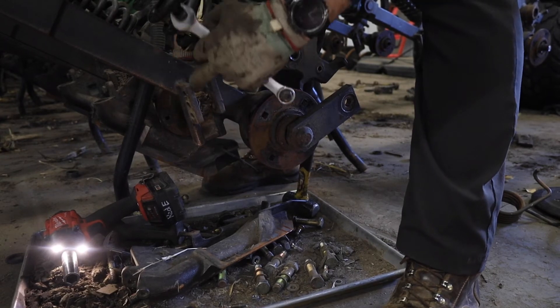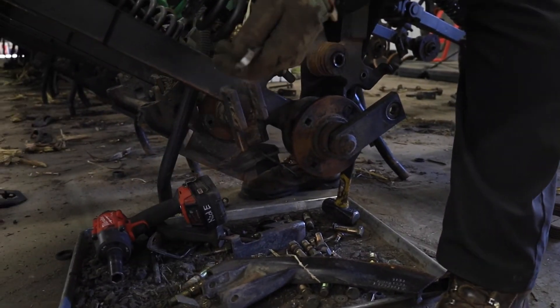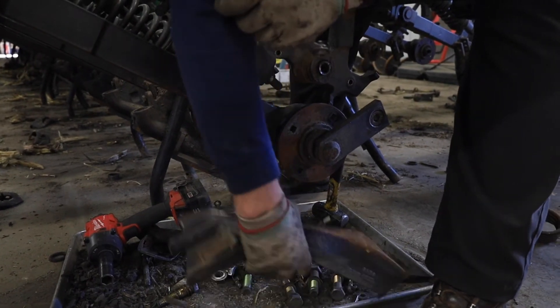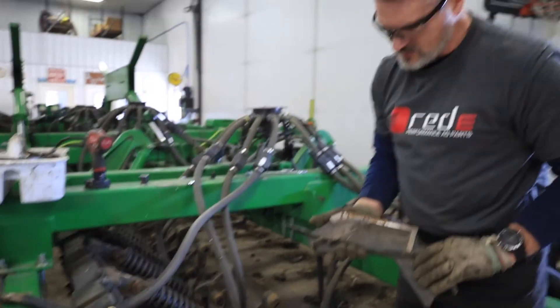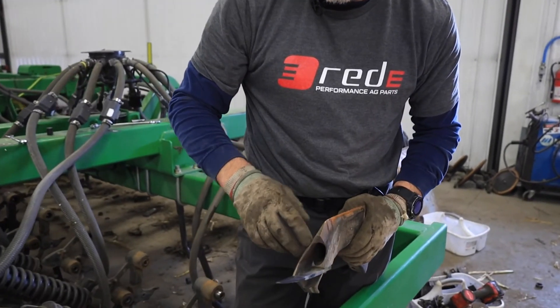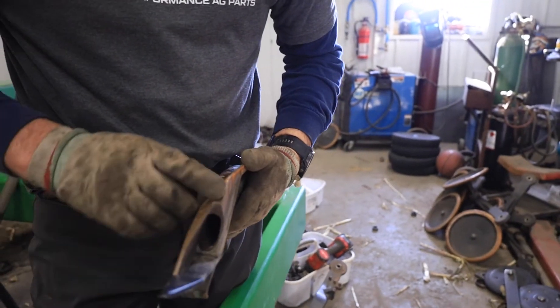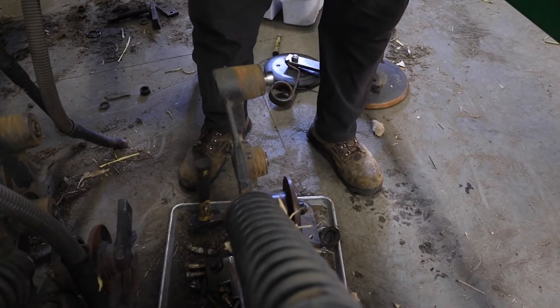She comes off just like that. You can see it has a seed boot spring — we'll put a new spring in. With this new seed boot, we're also addressing the wear we've got in the seed boot. We're going to have to address this wear with a new boot, and we're going to put a new tab in. Now that we've got that part stripped down — closing wheel arm pivot pin out and firming pivot pin out — they fight a little bit but they come out.